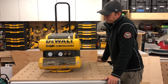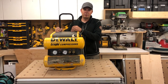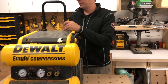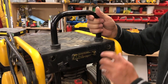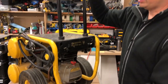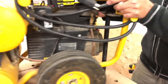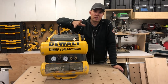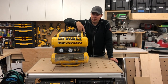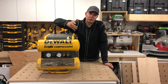I wouldn't recommend this compressor for roofing or repetitious nailing or framing — you want something bigger for that. You can frame with this, but if you had two guns coming off it you'll be constantly waiting for it to build up pressure. For framers, big tanks or belt-driven compressors are better. My preference is battery-powered or belt-driven for big stuff because they draw less power on startup and can just be left running quietly.